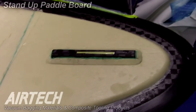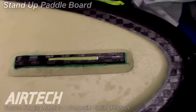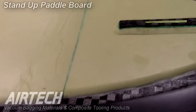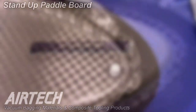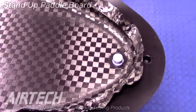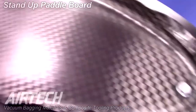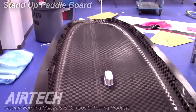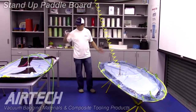We also gusseted the fin box with an extra piece of core — it'll also make the vacuum bag much easier. We applied more foaming adhesive; I could have done a little better job putting that in, but it's pretty forgiving stuff — it tends to go where it needs to be. We also want to put a leash on this thing so it doesn't get away from us in the surf. No problem — one thing good about composites: things are pretty easy to fix. So that's a good button, and we're going to fold this over when we put the two halves together.